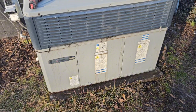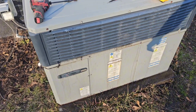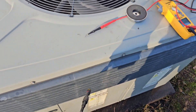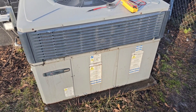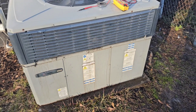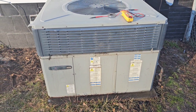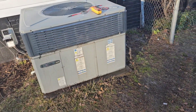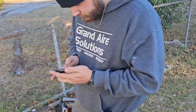That still didn't work — it's not shaking as violent now, but it's still shaking violently. I checked back on the video and the fan blades aren't really that bad. The amp draw is a little bit weird. So I'm going to quote them out for a new squirrel cage — I think the squirrel cage is out of balance since the whole thing's been running on three bolts. Going to call Trane and get this quoted out. Let's hurry up, I'm ready to go.